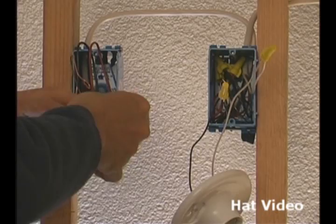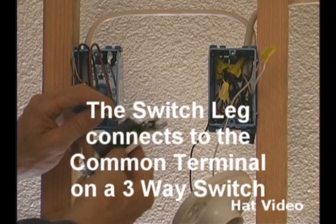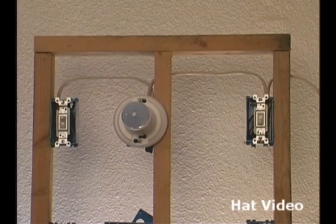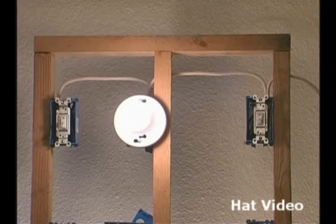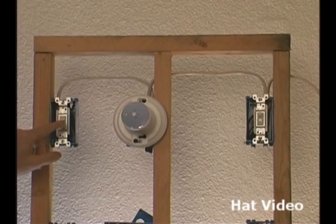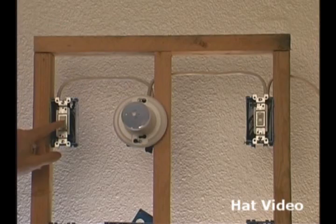On a three-way switch, a switch leg is connected to the common terminal. Let's go ahead and connect that right now. The common terminal is the one with the black screw, and we're going to use the push-in. I'm just going to put a curly Q in it as well. So we finished with our makeup and we've hooked up our power. We're going to take one three-way switch and turn it, and the light comes on. The other three-way switch should turn the light off — and it does. Then this one turns it back on, and this one turns it off. Notice I've got one switch down and one switch up — now if I put them both up...